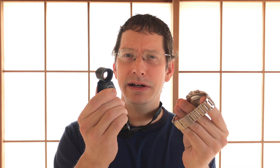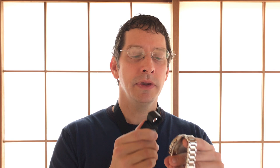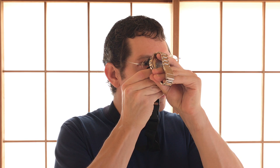Look at this — this is a 20x loupe. Under ideal situations, this is going to be better, right? Well, here's the thing: situations are seldom ideal. If you're in perfect lighting and looking at the exterior of the watch, this could be a little bit better. But in real world scenarios, the big problem is a very shallow depth of field — that's how much is in focus at one time, and shallow means it's very thin. You can pull focus on the outside of the watch, but it goes in and out of focus very easily. One thin plane can be in focus and just a few millimeters off to the side won't be.